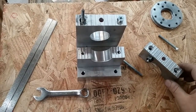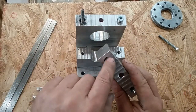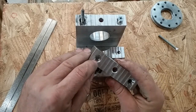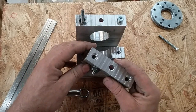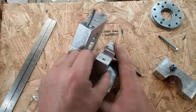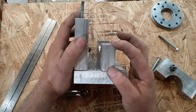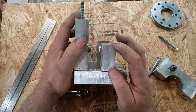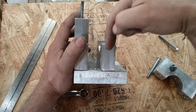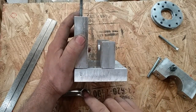The bearing caps are drilled through on the cap, clearance size for a 1/4-20 flathead machine screw. The bearing saddles are tapped, and being that this is 2 inches long and I did not have a pulley tap, I tapped from this side and then tapped from this side.